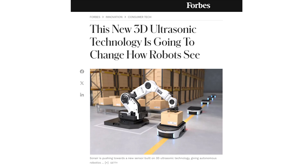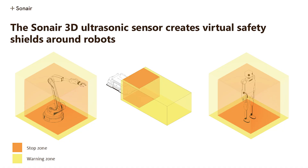For those of you who would like to understand more of the background of our technology, this Forbes article is quite good. We really do change how robots see. We say we build safety shields around robots. We are safety certifying the sensors — certifying to SIL 2, Performance Level D. This really takes the safety field around the robot from 2D safety lidars up into full 3D.